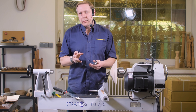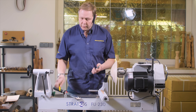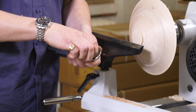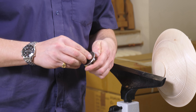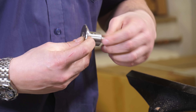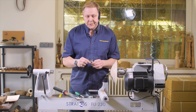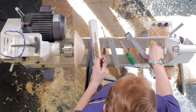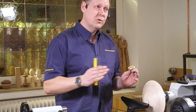The round one is maybe just a little bit more tricky to keep the burr on there. You can still use the diamond just to touch it up, but eventually you'd have to put it on the grinder, and that one is supplied with a little mandrel. This mounts on the small mandrel and it allows you to mount it into a drill to get it sharpened — I put it into a battery drill, run the grinder, and very carefully get those angles matched up just to touch those edges up. Normally you would do that when you first buy the tool, and then two, three, maybe four times you can get the edge on with a diamond, and then eventually go back to put that edge on with the grinder again.